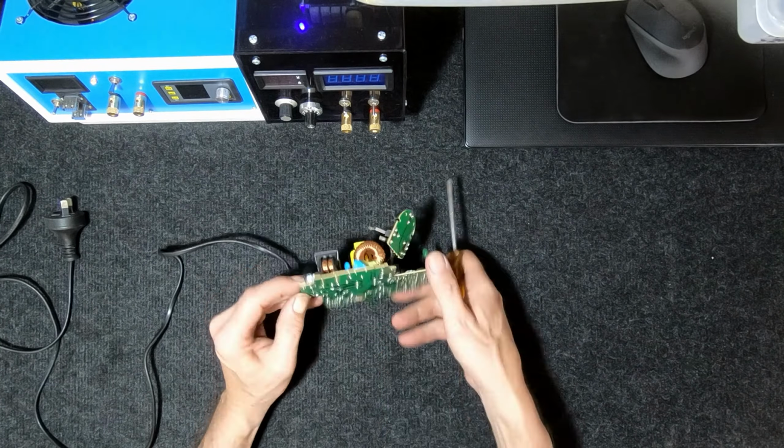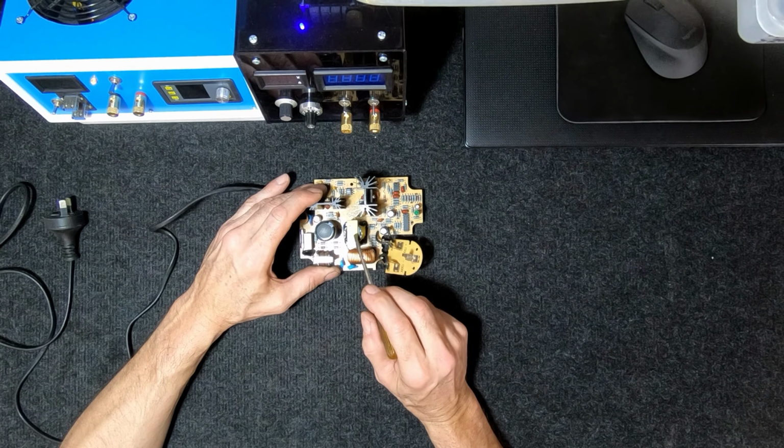Back in the old days, to get a 5 amp battery charger, which is what this is, you needed a transformer of that size. You can see the size difference. 5 amp continuous output from 240 volts. Big difference. That weighs about 2 kilos, and I don't know, a couple $100 worth of transformer there. This weighs about 100 grams, maybe 150 grams. Wee little transformer.